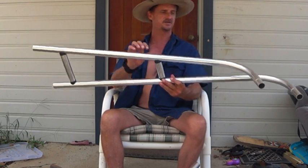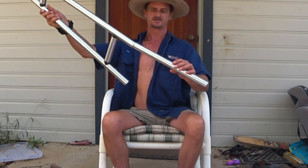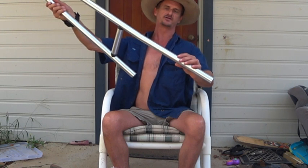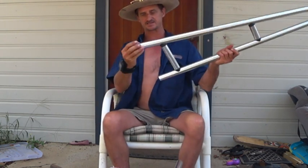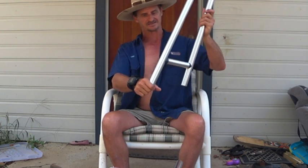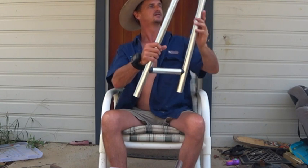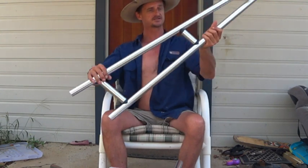So I've bought some davits on the internet — here they are. Originally they started off 400 millimeters longer to the top on both sides. Because they're a universal thing, I've cut that much off and we have little mounting brackets which I'll put in here and screw to the deck. I can't nut and bolt it through the McGregor's deck area, so there'll be an A-frame coming off the back of the boat to give it good support.